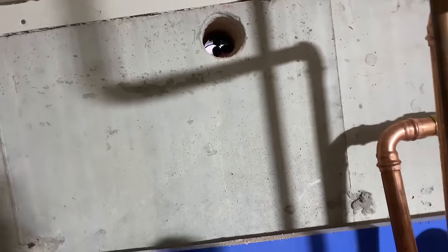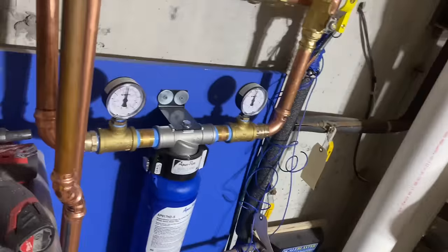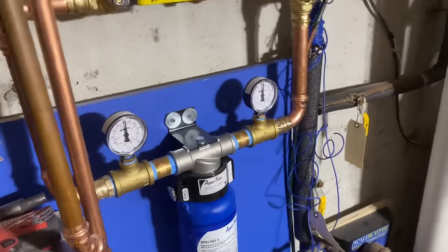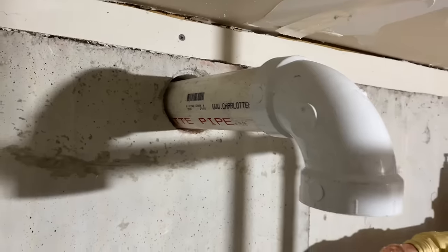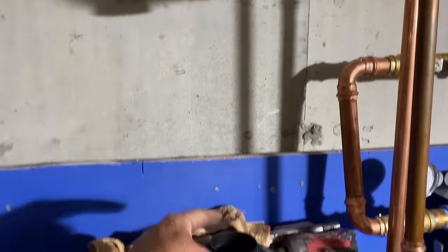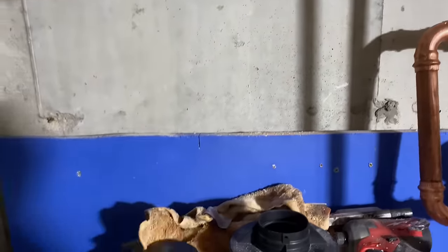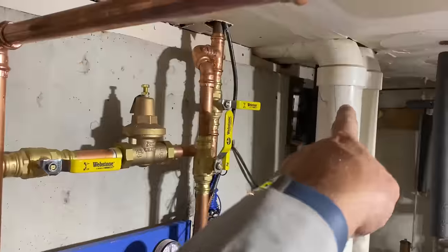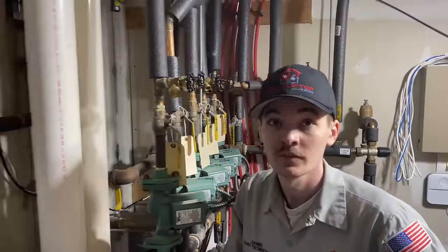All right. What is that, a leaf? What is that, cork? All right. Let's shove this pipe in there. All right, perfect. So we have our 2-inch pipe through the hole. We're gonna need a 15 and I think a half inch piece from there to there. And then for fresh air, we're gonna take from right there. It's gonna look really, really nice when we're all done.